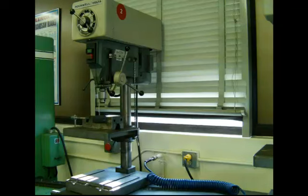On the very top of the drilling head, you will notice on this particular one there's a lever on the front of it, and this is meant to set the different speeds. This is meant to be set with the machine running. In other words, it has a split pulley in it, which is spring loaded, forcing the belt to go towards the outside diameter of the pulley or towards the inside, changing the RPM of the drilling machine.